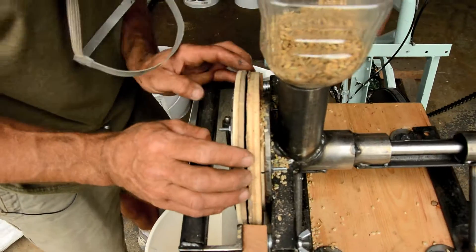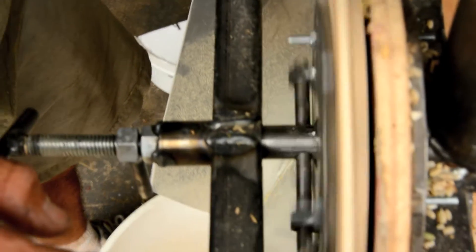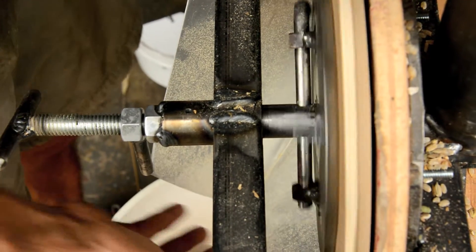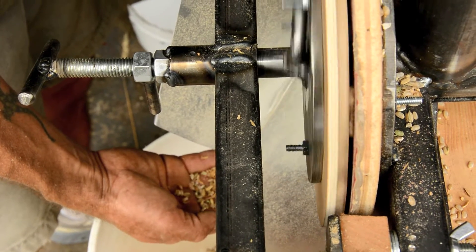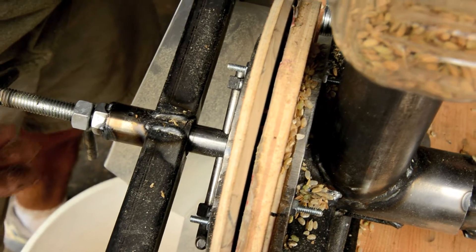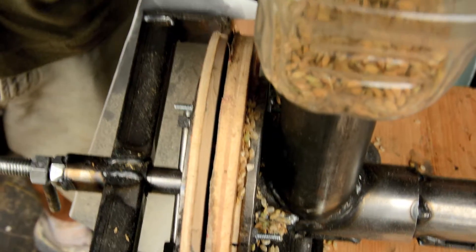There's a little hole for a drop of olive oil every now and then to keep it lubricated. When I set this up to de-hull, I tune it a little open. Go ahead and start pedaling, Josephine — you can pedal kind of slow. Then I bring it down a little bit until that's probably good. Then I check that we're getting the throughput and the de-hulling that we want, about 95 to 98 percent. Then I take what fell down and reprocess it. That's the setting for the rest of the run.